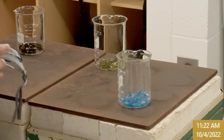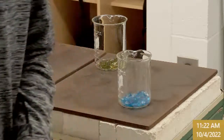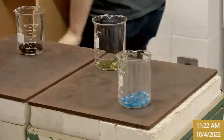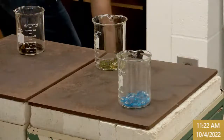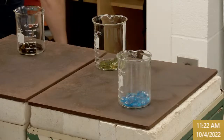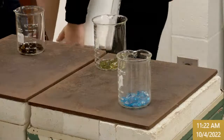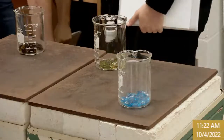So, silly question for you. Why is broken glass sharp? Is it breaking against the bond angles? It's not based on bond angles, it's the randomness. The stress fields can lead to very acute angles, and when those meet, you've got an edge that is only a few molecules or a few, let's say, atoms thick at the very end. So there can be little shards of glass, little flakes that are just wickedly sharp.